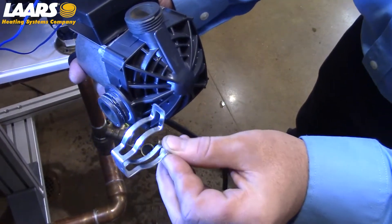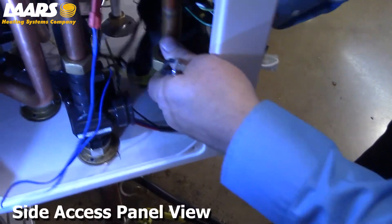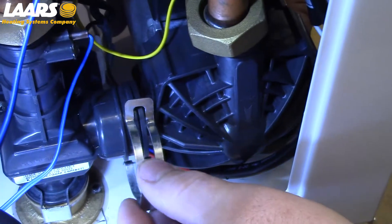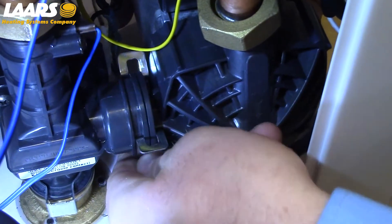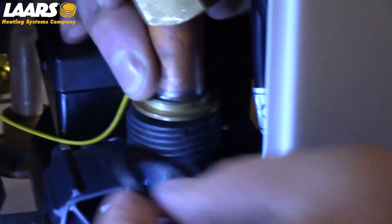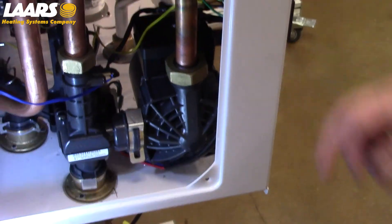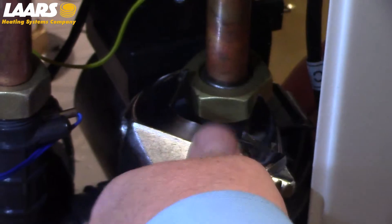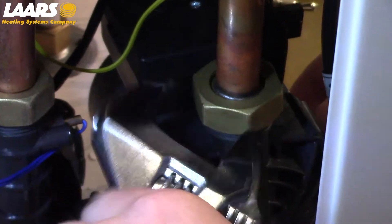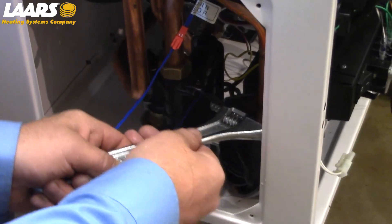To install the pump, I first insert the clip — please note, small side of the clip towards the pump. I then spin the clip to confirm it's in the groove. I'm then going to install the gasket on the top of the pump underneath the union. You may have to push up on the copper pipe to get your gasket in place. Before tightening the brass union, I'm going to install the two Phillips-head screws in the bottom of the pump to prevent anything from shifting. Now that my clip is installed and my two Phillips-head screws are lined up, I can tighten the union connection on the top of the pump. Please be careful not to over-tighten either one of these union connections — tight, or a quarter turn, is just enough.